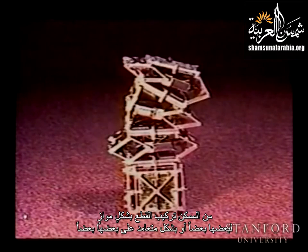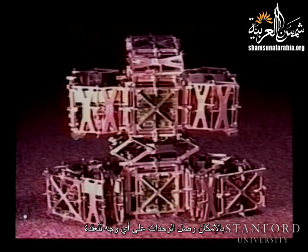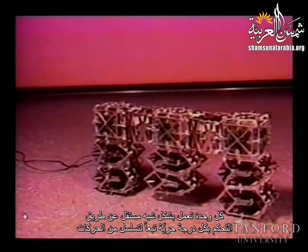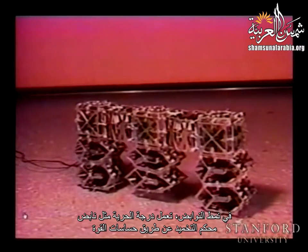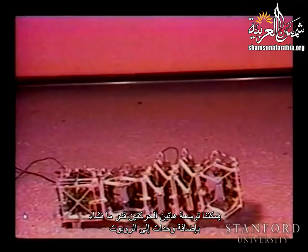Segments may be mounted parallel or perpendicular to each other, and modules may also attach on any face of a node. Simple locomotion gaits are statically stable gaits that move along a straight line. Each segment runs semi-autonomously by controlling each degree of freedom with a sequence of behaviors. All of the following motions use two simple behavioral modes called ends mode and springs mode. Many of the gaits shown are extendable to an arbitrary number of modules.